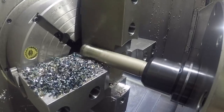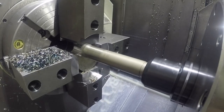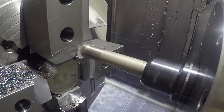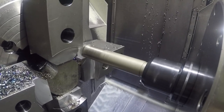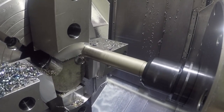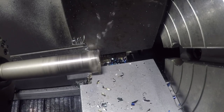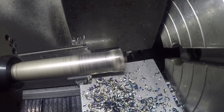I bored the ID of the jaws after I did all this. I found a scrap piece of pipe laying around in the shop and I clamped the jaws on the counter bore. I didn't take any video of actually boring the ID. It has to be bored to three and a half inches for the shaft part of this ram shaft piece. When I turn it around for the milling, here I'm just milling with the feed mill down to knock the corners off of the jaws.